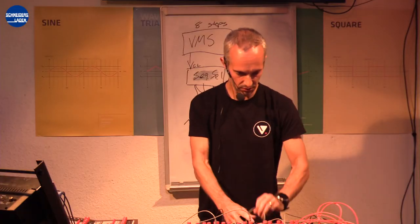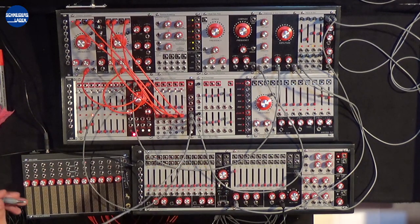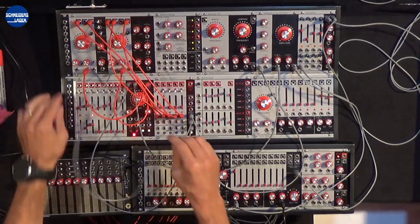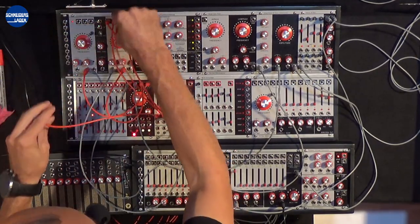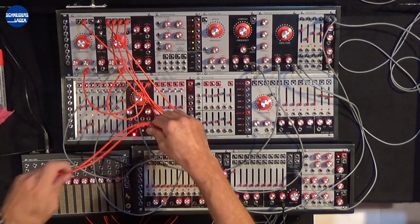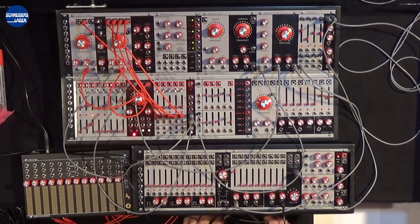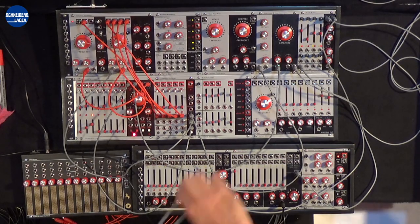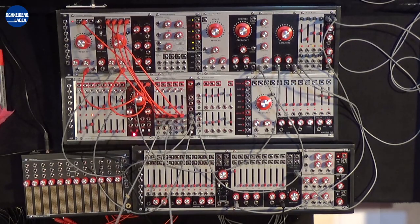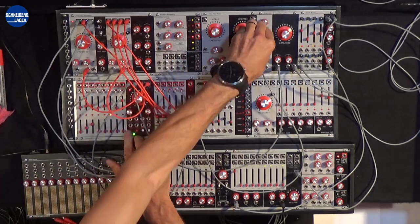But another thing that I totally should have gotten into before would be that you could also have the source be different. First of all, you don't have to have every input connected to something, so if there's nothing connected to a certain stage in the sequence selector, it will just sit at ground. But in this case, if we use the second one going into the FM input on the primary,